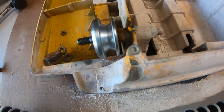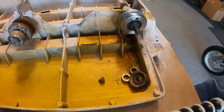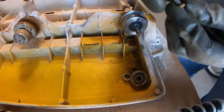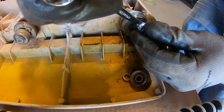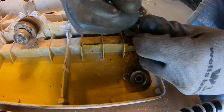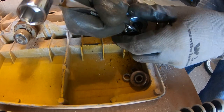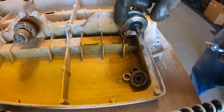That one's all seated — took about three taps. When these old bearings are nice and clean, they cooperate quite a bit better. At this point we just need to reinstall the screw — we don't want to forget that. I put it back on the wrench; it has a little bit of blue thread locker on there. If you want to put another dab on, by all means — I've never done it and never had a problem. Torque spec? I have no idea. If I had to guess, maybe 10 pounds is all I'm putting on that little screw.